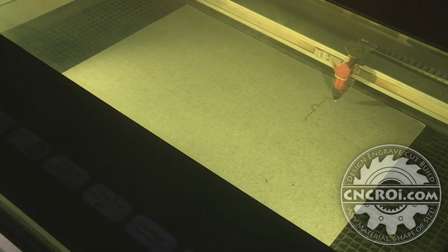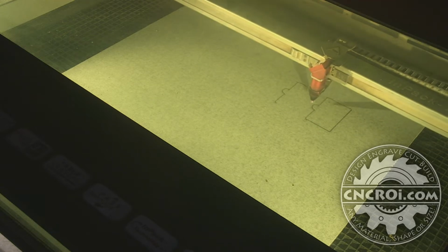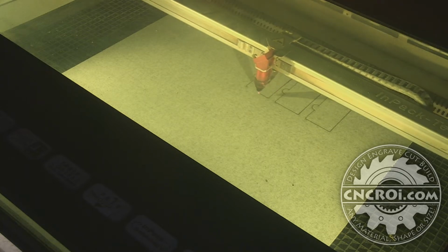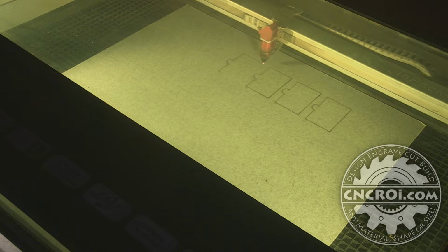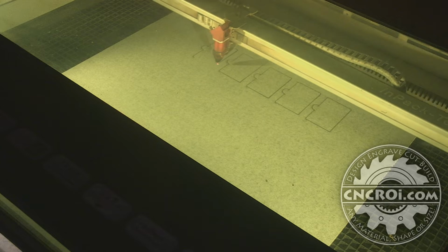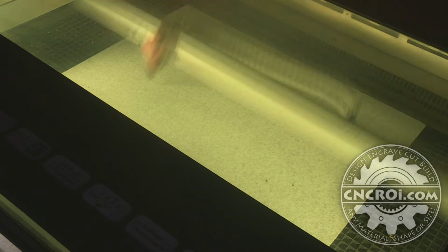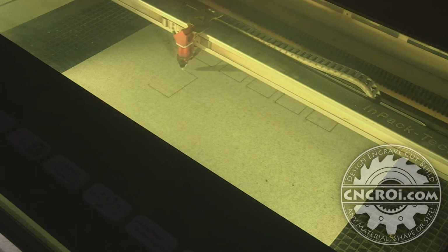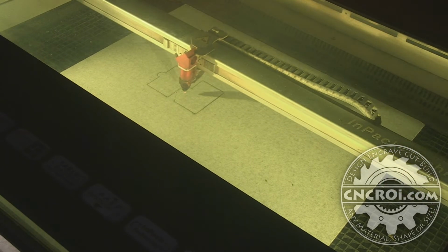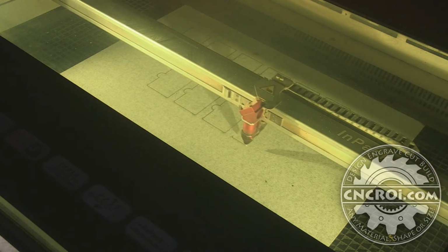Something to keep in mind is jig placement. You don't want the jig so squished with stuff on it. I know for UV printing, if it goes over an empty space, it's wasted time on your machine, not necessarily wasted ink. But when it comes to actually making a jig that won't warp or have issues during your UV printing process, you still need to leave enough material so the jig itself is structurally sound. I get some files from customers sometimes, and there's less than a 1/16 of an inch between all these different components, and it just doesn't work, because one, it can be damaged during production, or here in the shop, or during the glue up process.